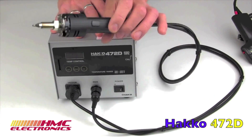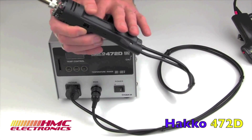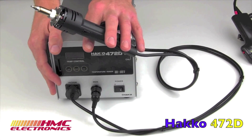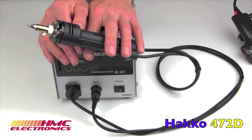The tool is 110 watts, whether you go with the inline pencil or the pistol grip, and the temperature is fully adjustable from 642 to 842 degrees. It doesn't go below 642 because obviously you're not actually re-flowing your solder if you go too much below there.